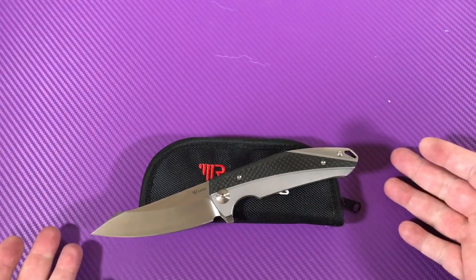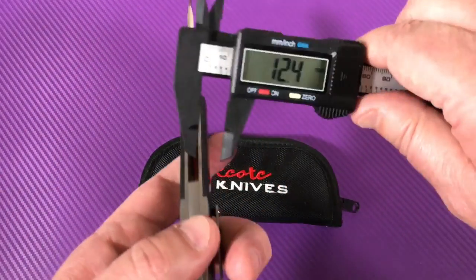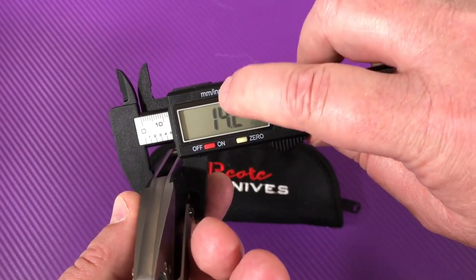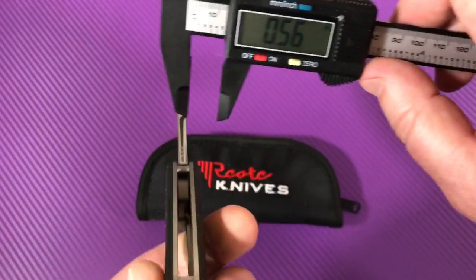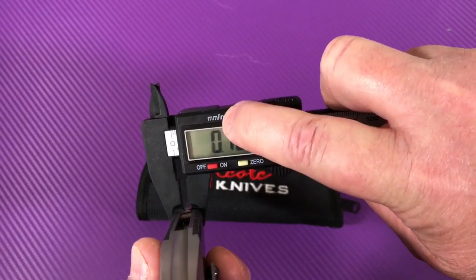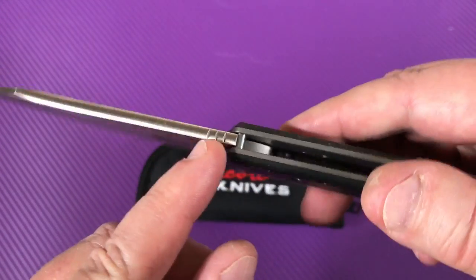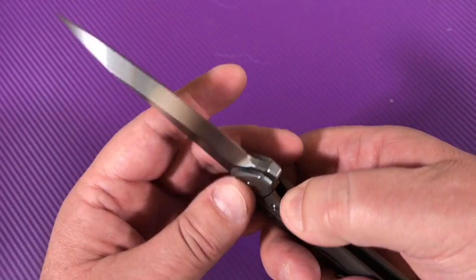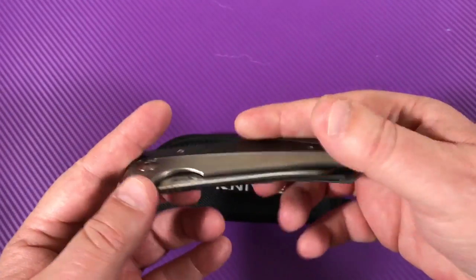These knives — they're not giving them away. What a surprise, huh? Let's get some measurements. It's 14 millimeters across — 0.56 inches — so that's a good thick handle to get your hands on. The blade steel is 0.15 — that's four millimeters. Nice heavy stock. Doesn't look that heavy when they crown the spine like that. Here's your blade stop up here. Good detent. Beautiful stuff.